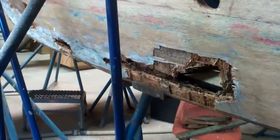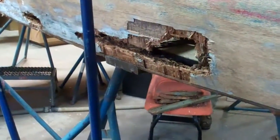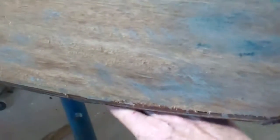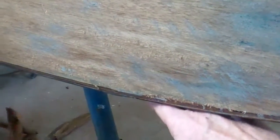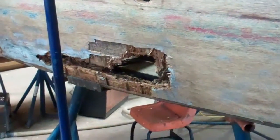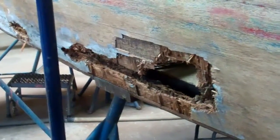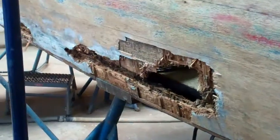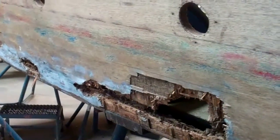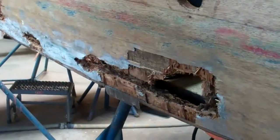She's really a beautiful boat in great shape everywhere except the fiberglassing that was done. It came up the transom quite a ways, wrapped around and extended a few inches forward on the bottom planking. The result was that the original drain hole in the transom was covered over, so water simply settled back there, got nice and comfortable and warm, and soon had the company of lots of little friends as rot spores began to develop.